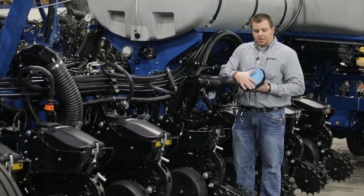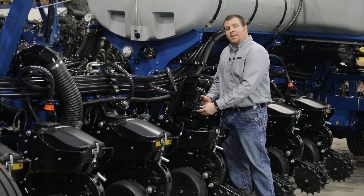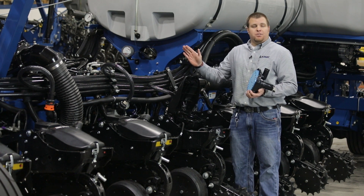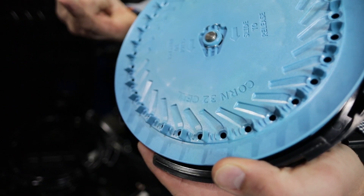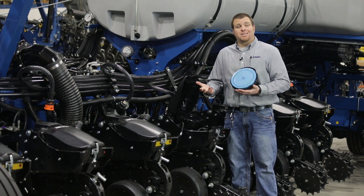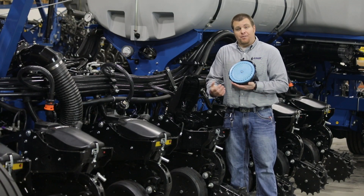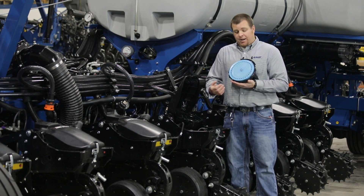Really, the unique part of the TruSpeed meter starts with the disc itself. The meter orientation is significantly different than our TruRate meters as well — it's perpendicular to our direction of travel. As we look at the disc itself, the first thing you obviously notice is our tall paddles on the disc. The big function of these paddles is to hold that seed in those pockets, especially as we get into a higher speed application. The other unique part is we can see our channels that really help funnel the seed into the pocket. Of course we're using vacuum to retain that seed in the pocket, and the paddle behind it helps keep the seed in that location as you're traveling at higher speeds.